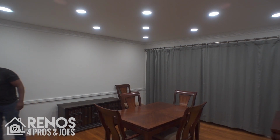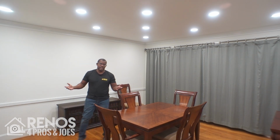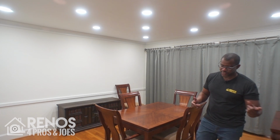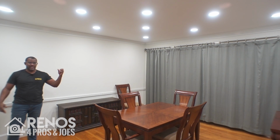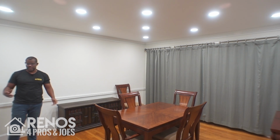I'm going to go ahead and bump it back up just for the sake of continuity so that I can walk around the space so that you can see how things look in here at 3500K. So we've done 2700, we've done 3000, we're now at 3500. Hopefully you're able to see that the color is becoming more white and more blue, and we're gradually having less orange and now less yellow in the overall color temperature.